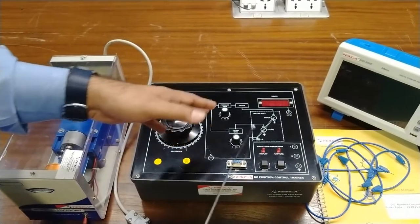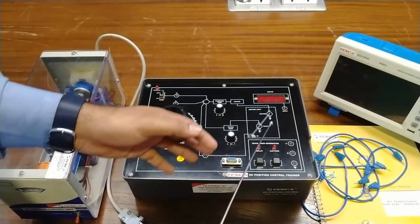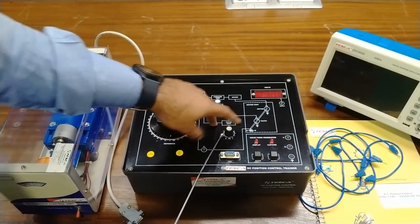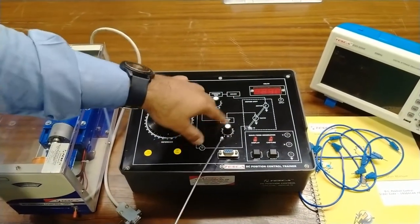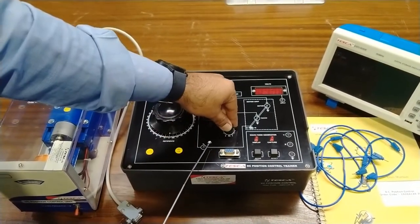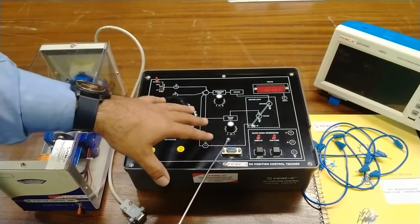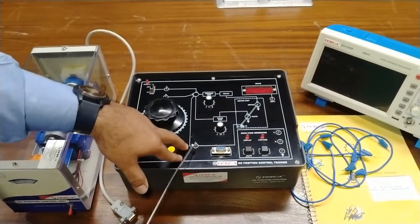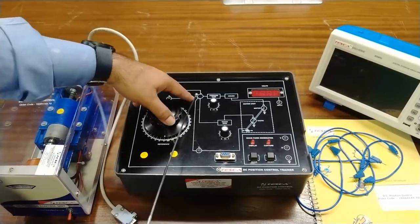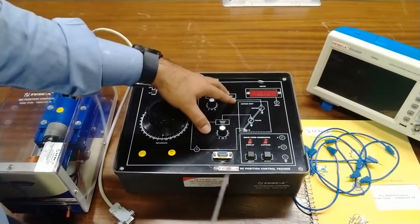This is the basic description of the motor unit and tachogenerator unit provided in the motor section. The tachogenerator output will be combined with the tachogenerator gain — represented as Kd — and the forward gain is represented as Ka. The tachogenerator gain can be changed from 0 to 1. The output voltage can be calculated from the V0 point, and this will be provided via the closed loop system of the DC motor control unit.